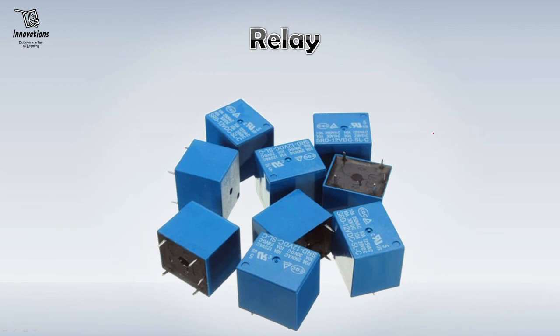The next component is relay. It is also a very important component. Relays are mainly used for driving high voltage loads with low voltage project circuits. So when you are building a project with 5V, 9V or 12V, you can use a relay to drive 220V or 110V devices. There are relays available of 3V, 6V, 5V, 9V, 12V — you should buy as per your requirement. I would suggest you have at least a 5V relay and a 12V relay in your project box. The 5V relay would drive fine with 3.5V and the 12V relay would drive fine with a 9V project.